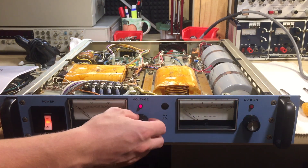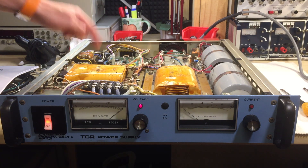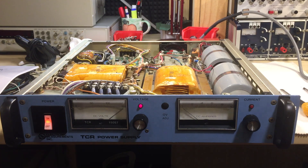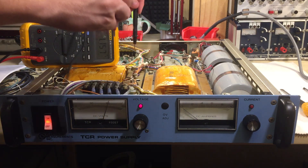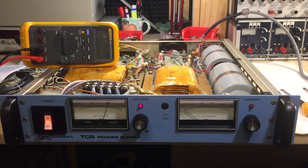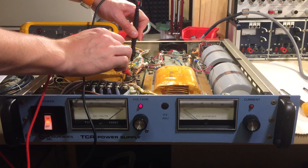We're in current mode right now. Let's go up in voltage — and there we have 150 volts. The transformer is a bit noisy, buzzing a little, but we have 150 volts on the terminals. Let me check the voltage at the transformer terminals. At 100 volts output setting, we're reading 88 volts at the transformer — after rectification and filtering it comes up to 100. Pretty good.